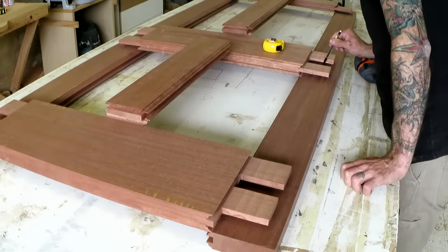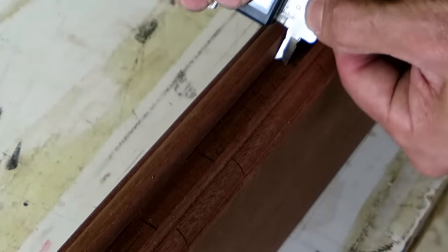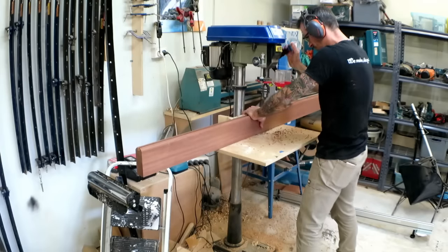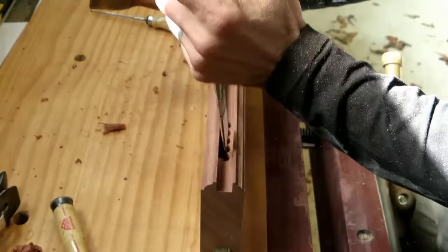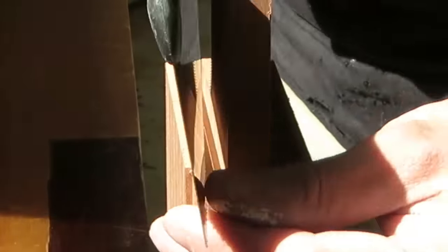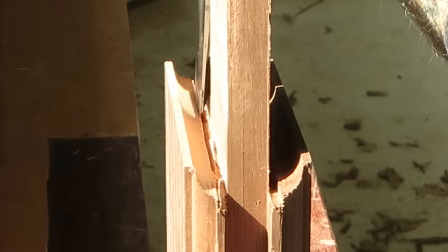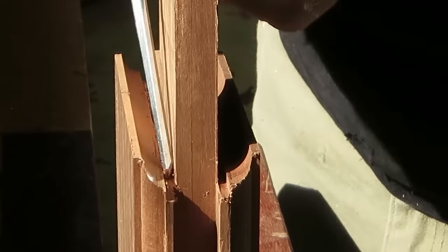With all the pieces cut and moulded I can mark out for the mortises. I was planning to use my benchtop mortiser but it wouldn't go deep enough the way I wanted to do it, so I ended up setting up my drill press and drilling a bunch of holes. Then I spent the better part of a day cleaning out the mortises — ten mortises total. Something was off by about half a mil with the coping bit, so I had to trim out inside the coped area, which ended up taking quite a bit out just for the size of my 4mm chisel.